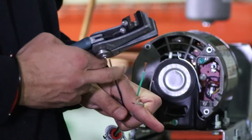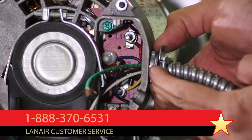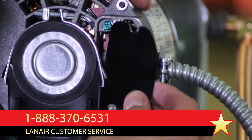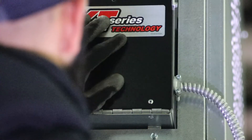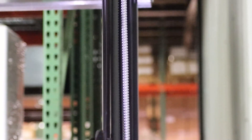The product manual also contains important requirements and guidelines for the dedicated electrical supply to the unit. If you have questions about your particular installation, contact Lanair Technical Support for further assistance. Use the electrical conduit provided to connect the pump to the junction box on the heater cabinet. This is also the location for an electrician to connect your incoming power supply conduit. Leave the circuit breaker off and locked out until the unit is complete and the heater is ready to begin the startup sequence. Replace the junction box cover and connect the wiring harness to the burner. Secure any excess slack in the conduit to the frame of the unit.